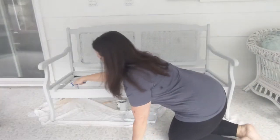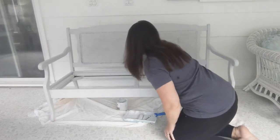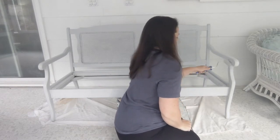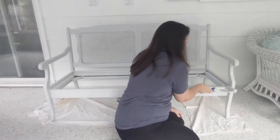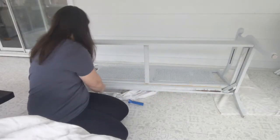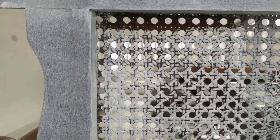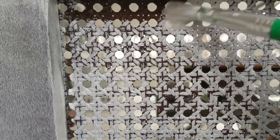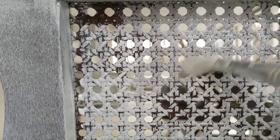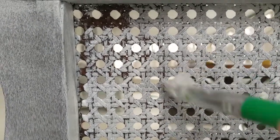For my bench, the next thing I need to do is use some wood filler to fill in those holes where the details on the sides used to be and put on a coat of primer. I used Zinsser oil-based primer to prime my bench — it's my favorite primer for painting furniture because it sticks to any finish and it seals in wood tannins so that they don't bleed through your final finish and yellow your paint, especially when you're painting a light color. Then I followed that with a couple of coats of a light gray exterior paint. When you're painting caned furniture like this, it's actually the perfect time to use a paint sprayer, but this time I used a foam roller and a paintbrush instead. The main thing to keep in mind is you want to use as little paint as possible to get good coverage because you don't want to gum up the caning. I found the best way was to put a very light coat of paint on with my roller, then use a small brush to spread it out to make sure there weren't any thick areas, and I made sure to check the other side of the caning each time I painted to make sure it wasn't dripping out the back side.